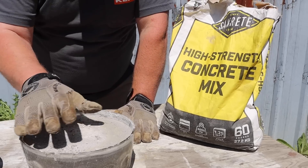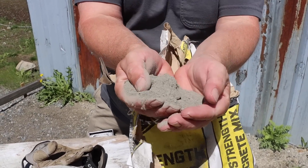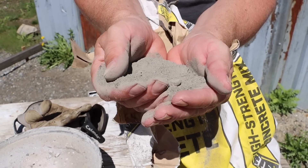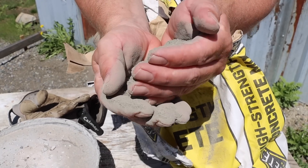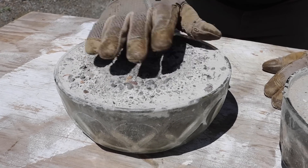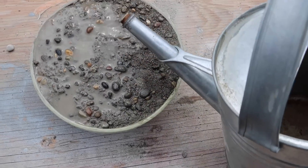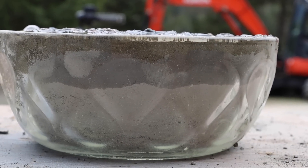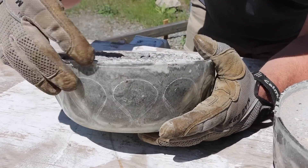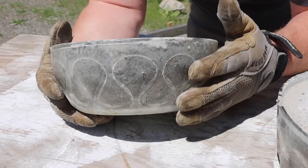We put it in a bowl and took a look — it created what you'd expect for wet pour concrete. The mix is real powdery and dusty with some aggregate, a little sand, and some cement. For the dry pour, we poured the concrete in and smoothed it out, then dribbled water on it and watched it work its way down, hydrating as it went. It definitely seemed like the water pooled on the surface for a long time — in fact, it was over an hour before we got full hydration.